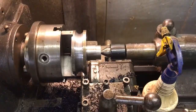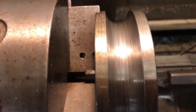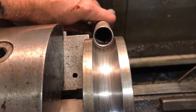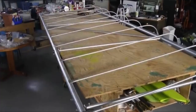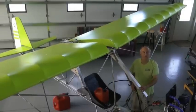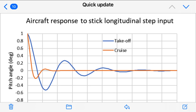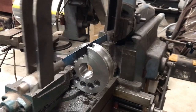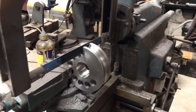I'm planning to go for a wing loading of around 29kg per metre squared, which should give me a takeoff speed of around 30mph with the wing in ground effect. The construction of the wings will be an aluminium tubular spar and Dacron wing covering. The tail will be the same type of construction, but I need to decide what size horizontal stabiliser, what size elevator, and the same for the vertical stabiliser and rudder — and how far aft it needs to be for effective control. I would particularly like to thank Martin Garish for all the design help I've been receiving. I'm okay at building things but need help when it comes to complex design decisions — you can build by copying what others have done but you might also be copying their mistakes, so best to do what you can to make the right decisions.